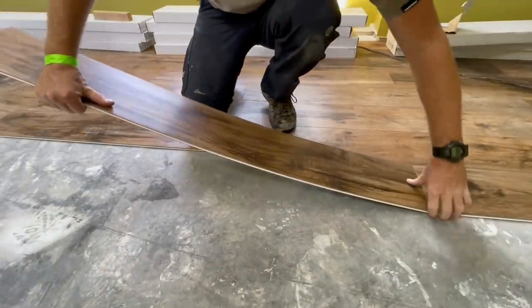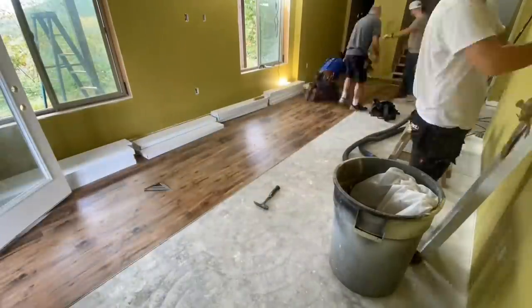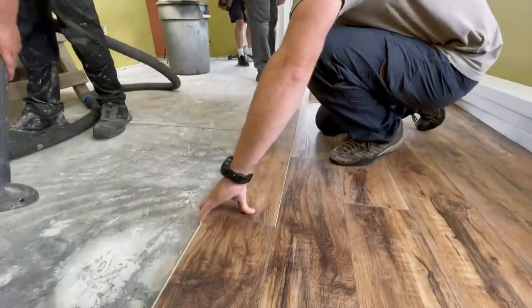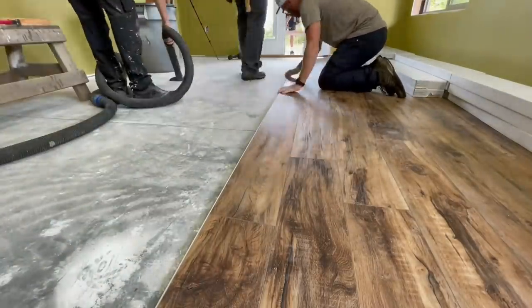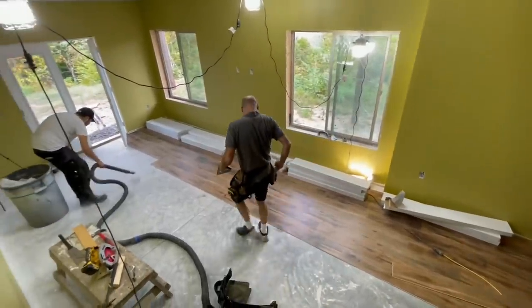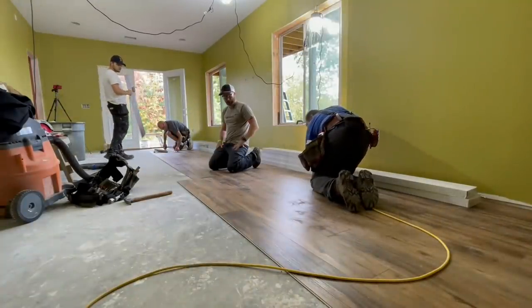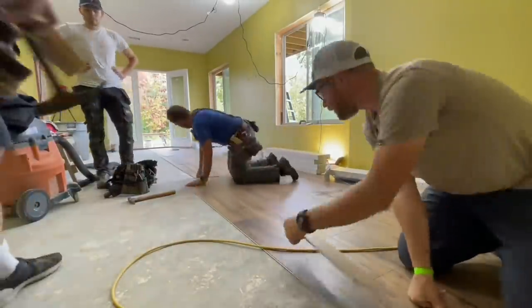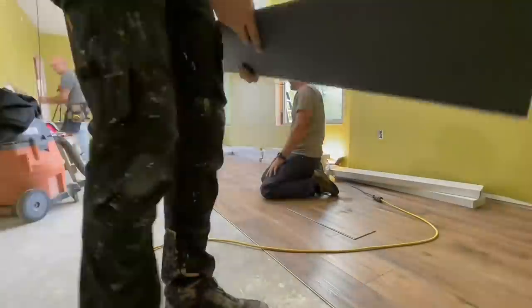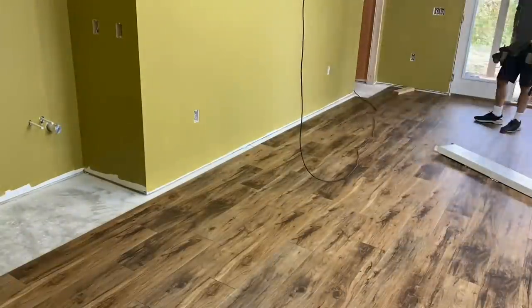After a little practice, I found you could install pieces with no tools by installing the butt end and tipping the previous piece up at a slight angle so the tongue snaps into place. I will say this isn't always the case — I've put in floors where it was a battle to click them together. I feel like we lucked out on this one. Just like upstairs, I was shooting for a random pattern on the butt joints so they don't align too closely. We finished this 14-foot by 25-foot room in less than two hours — about half the time I was expecting.